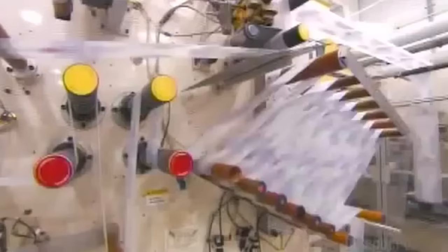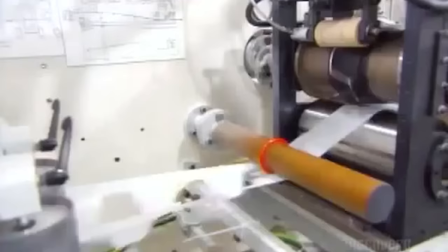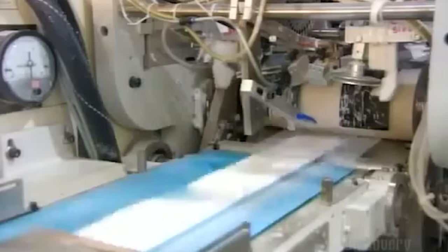Coming back to the process of manufacturing, this polymer is added in the form of tiny granules between two cotton pulp cores. As a result, the cores can keep the baby comfortable and help the layer of polymer get the liquid evenly. Once these chemicals are packaged between the pulp, all that's left is to add the plastic and fabric bits that hold the diaper together. The completed cores are brought onto the next section where a completely watertight layer of plastic is added to their outer side to prevent any remaining chance of seepage or wetness. While this is happening on one side, another station assembles the inner and outer sides of the diaper by combining and sewing together a few layers of synthetic fiber that give the baby the most comfortable experience possible.